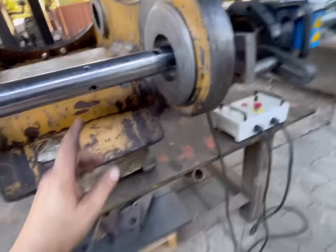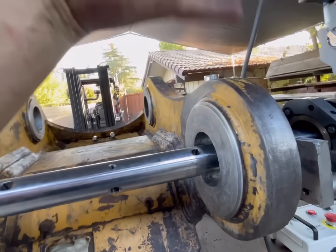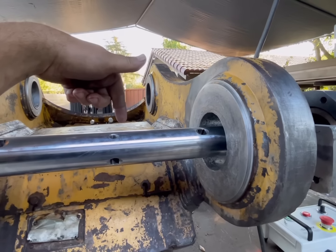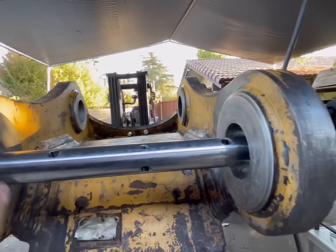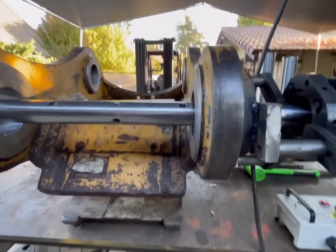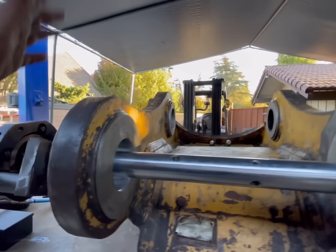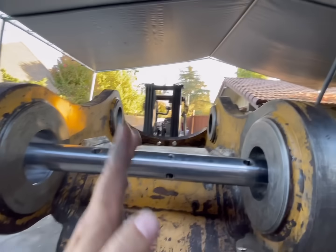So as I was pointing while the machine was running, I can't talk because you won't hear me. I was kind of going like this on my finger. If you look, you can see the bar has had deflection, like the bar was moving. So every time that bit moved around, it was kind of moving the bar. So my bearings are too far apart,